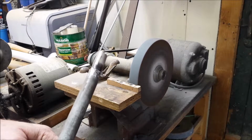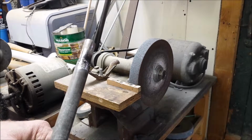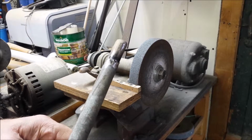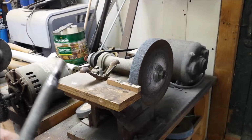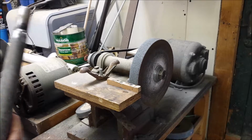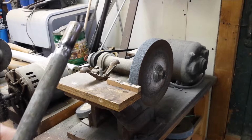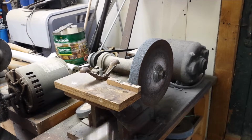Since this will be down against another roller, you can't have any of those welding lumps out there because, well, it needs to be flush, right? Anyway, let's find a flat piece of table or something that I can find out just how far that thing pulled when I welded it, in spite of my best efforts to make it lay flat.